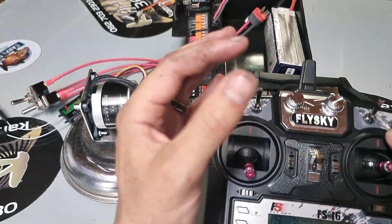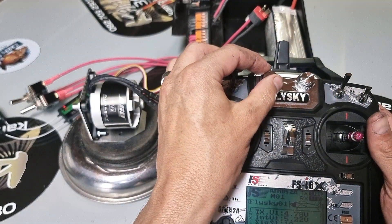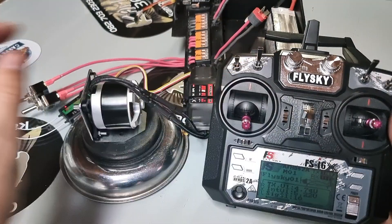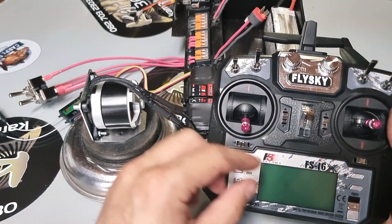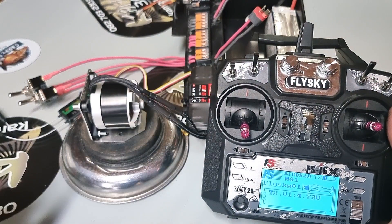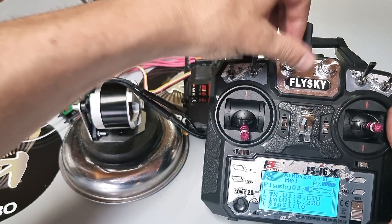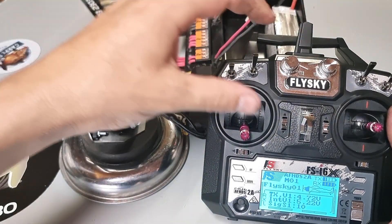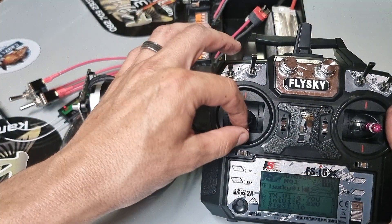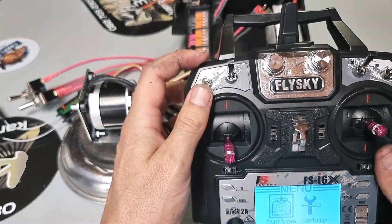If you're flying a plane full reverse power is great, but on a bait boat you don't want to go to 100% reverse — you'll get yourself into trouble. Also keep in mind: if you boot your remote and the reverse control is not at zero, the system won't boot. It must be on the zero point for both channels. For the guys who call me saying their boat won't start — make sure both controls are back to neutral.